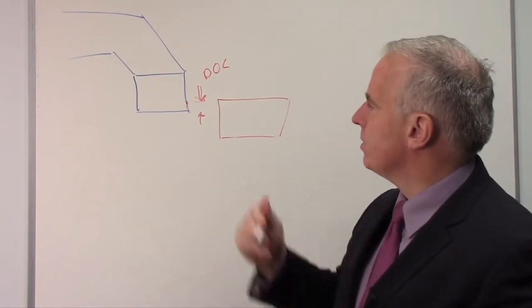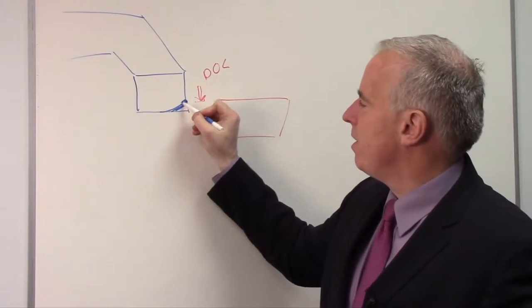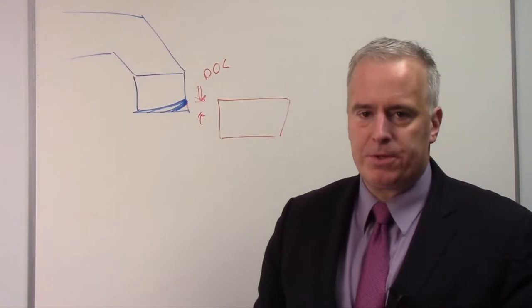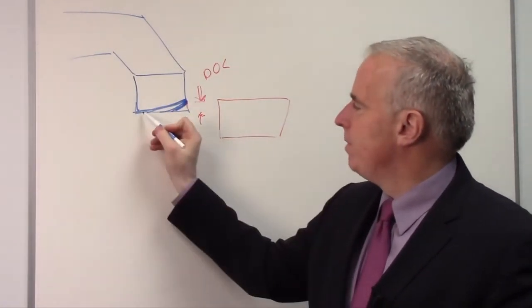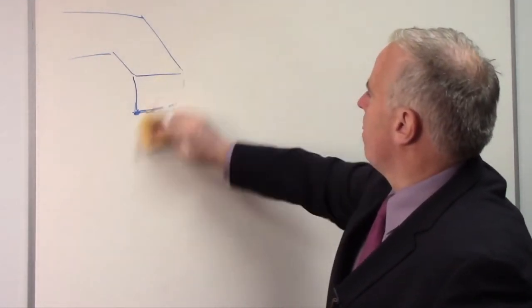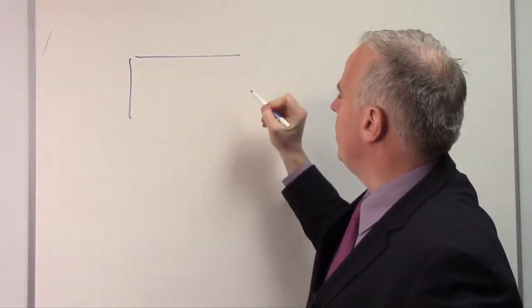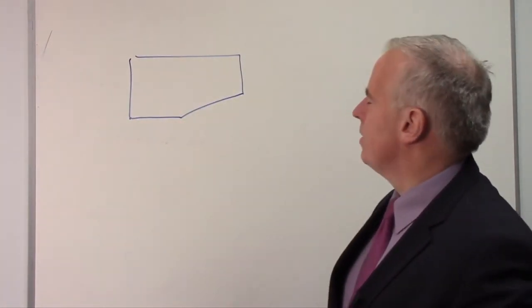Then the wheel is going to start to develop a taper. It's going to go from there to there to there, and then maybe to there, and then it'll hit some sort of steady-state value. Quite often when you get to this point, your surface finish gets bad, because you don't have much finishing width. So what I encourage my customers to do is to true a taper in the wheel.